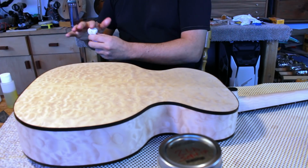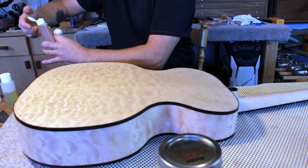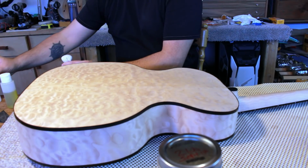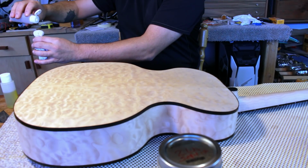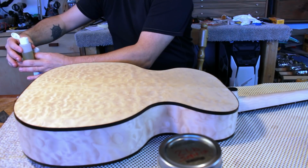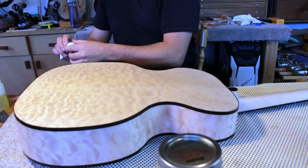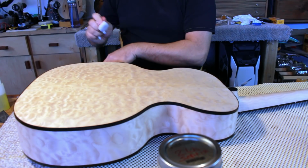What I'm going to do first is the pad is already pretty charged, but it's only 1 pound cut. So usually when I recharge, when I feel like there's no more in it, I'll put between 7 to 10 drops. But right now I'm going to put only 3 or 4. And then I'll put 1 or 2 drops of alcohol. Just a little dab of olive oil, especially now that the pad is pretty new, so the chance of it sticking is greater. Then you want to mix everything together so you can tap on your hand. That would take off the excess, and then you can start your French polish.